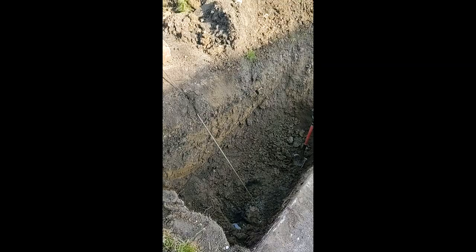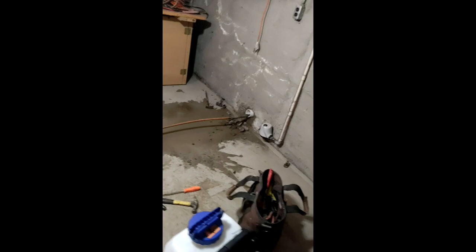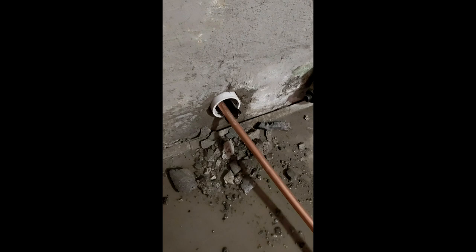As we get ready to go back into the basement and watch the wedge cone head hit the edge of the galvanized as the excavator pulls on it, there are so many variables — how old the pipe is, how long it's been in there, what shape and condition it's in. This one actually took a lot of force to blow apart. Let's see if I can play that in slow motion.